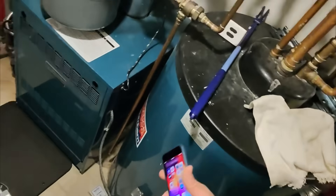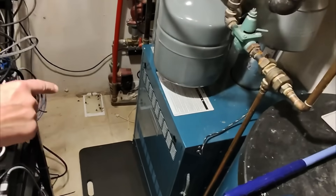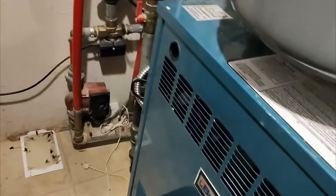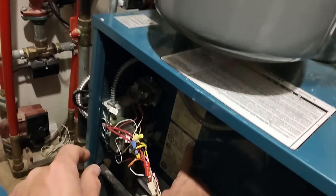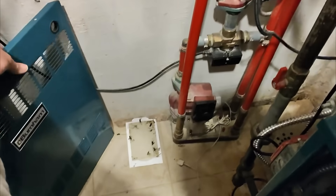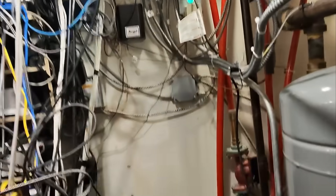Like, what don't I have? What should be good? What can I swap out? What I don't have is 20 pounds less weight, and then I'll be all right. Ladies and gentlemen, we've got this Burnham P20 — I'm going to guess it's a 5 or a 6. Let's see what size this boiler is. Just 5. 206. Manufacturing date of April 2007. 164,000 BTU hydronic gas-fired boiler. We've got a glue trap there that we're not going to step on. We've got water cop sensors everywhere. The one thing that's been very sensitive is that little water cop — I've had a lot of problems.